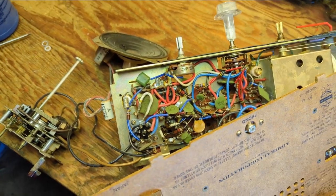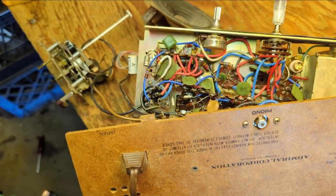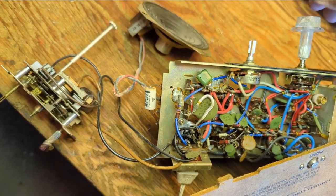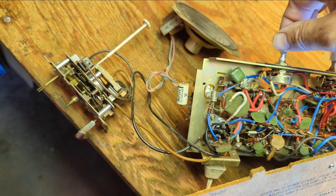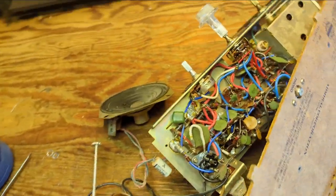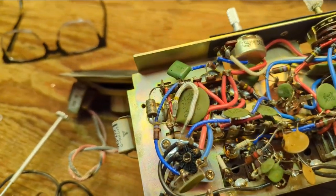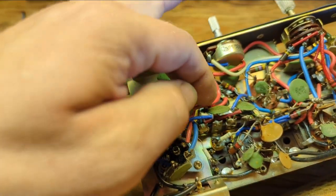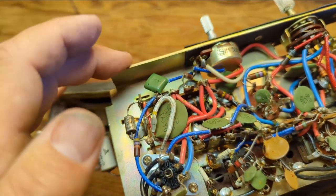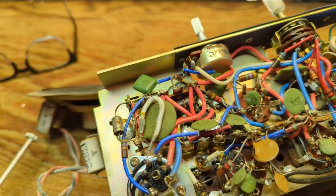I thought I was going to be able to get off scot-free without having to replace capacitors, but the electrolytics are on their way out — that's AC pollution. By granted, I'm still getting radio, but it's complete AC pollution across the board. The good news is we've got three values on these pretty generously long wires, and the thing is this is chassis ground so we can stick our grounds anywhere. Screw it — I'll bite the bullet and replace these electrolytic capacitors, because otherwise it ain't going to work right.